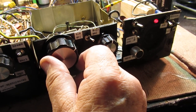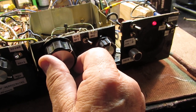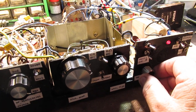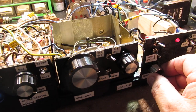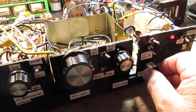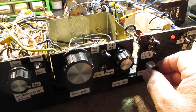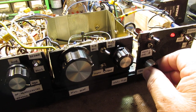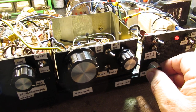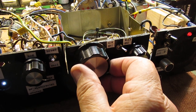Well, here are other radio stations. Perhaps when the night goes in, they are received. At the moment, not. This receiver does not have an automatic gain control in the IF amplifier, but anyway, it cannot help when the radio signal in the ether, as far as that exists, is not fierce enough to be received. Has also to do with your antenna, anyway. The quality of your antenna. Let's try again.